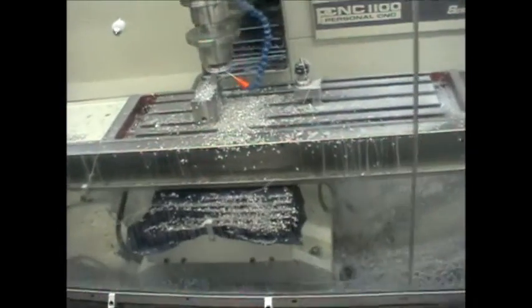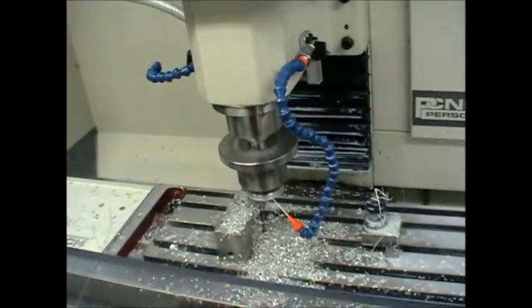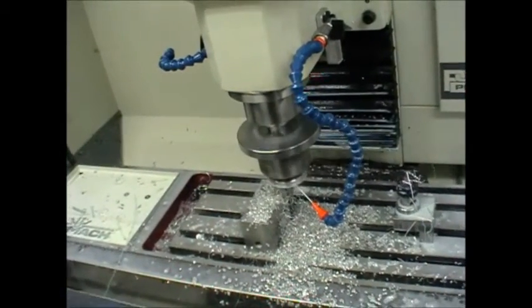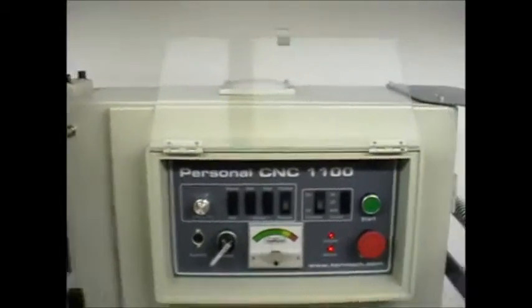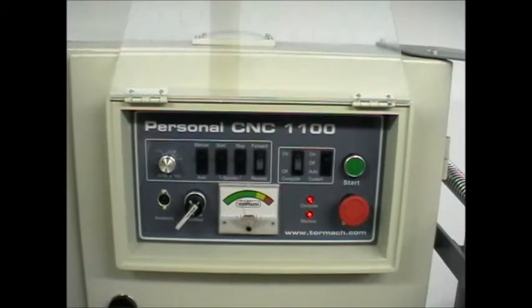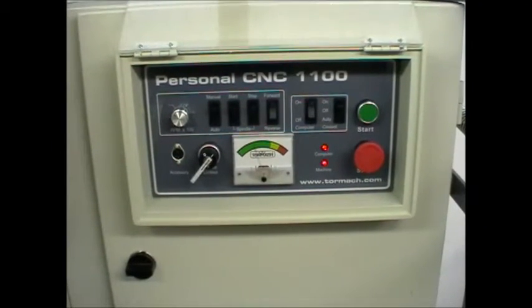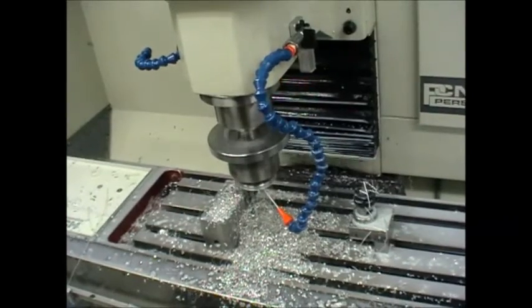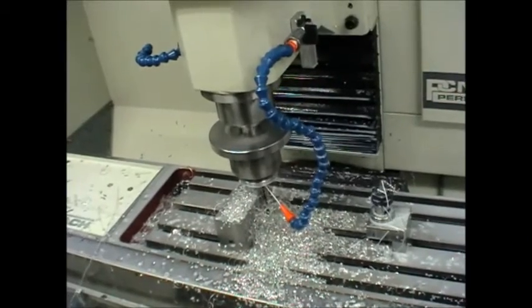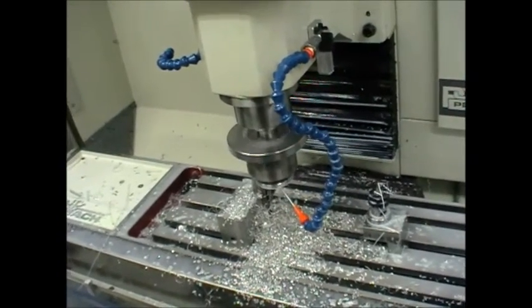At 2000 RPM you wouldn't want to go any quicker than that. There's quite a bit of power if you've got a free cutting tool. I'll show the amp meter running in a minute during a roughing cut. I noticed when I got the chip breaking working correctly, the amp meter showed a lot less load on the motor. We'll zero in on that now — coming up to a roughing cut. So that gives me confidence in this setup. Machining steel at say 60mm diameter, I'm pretty confident I could machine steel to an even bigger diameter with light cuts. It's certainly got the rigidity and the power for this sort of work, which is very pleasing. It's just worth doing the effort to set your CNC up as a lathe.